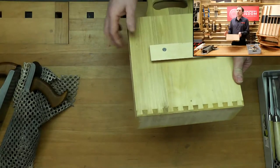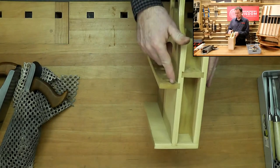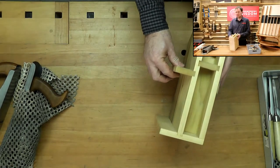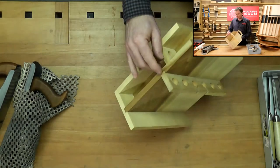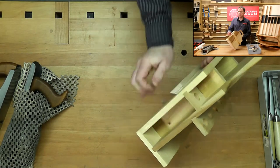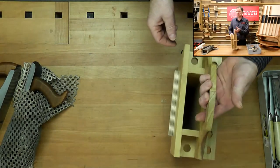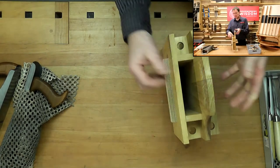The dovetail jig cuts a nice joint in that corner, making it incredibly strong. Our grain direction is running up. On the side and through to the front, we did a sliding dovetail that comes all the way across the board, so this rail can slide down through. I glued it in place with just a little spot of glue — didn't want too much — so there's a small movement gap where the wood has shrunk just a little bit, trying to allow that movement rather than restrict it. This little block gave us strength to have a handle and put the cleat system on the back.